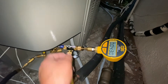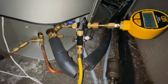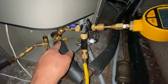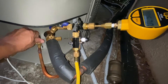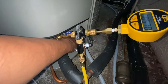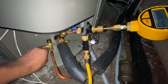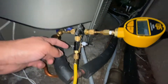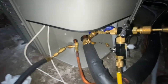That's just to show you that it does — it acts as a little vacuum pocket and you isolate that from the system. At this point I am ready. You definitely don't want to undo any of the connections because once you do that it may suck in some air and you may lose your actual vacuum, so I'm going to avoid that at all cost. Remove this and just double-check yourself one more time to make sure this valve is off, your meter's off, and this one is off. Now we're ready to release the vacuum.